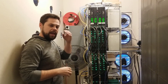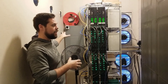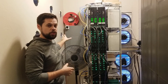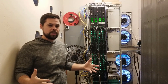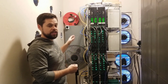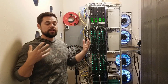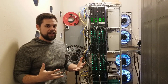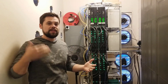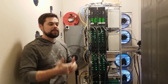I've got 12 of these holes, and I had my electrician install a new electrical panel — this is dedicated just for this room. It's 200 amps. You need to remember that you can only use up to 80% of the amperage that you have installed. So this is 240 volts at 200 amps, so I can use a total of 160 amps. The easiest way to calculate that is to convert everything to watts — volts times amps equals watts — so 240 volts multiplied by 160 amps gives you the total wattage of miners that you can run.